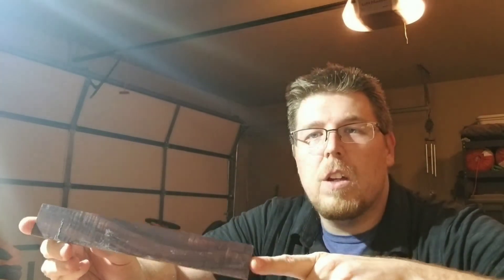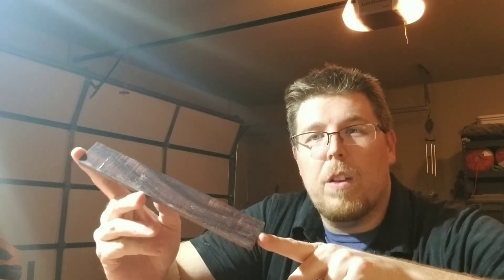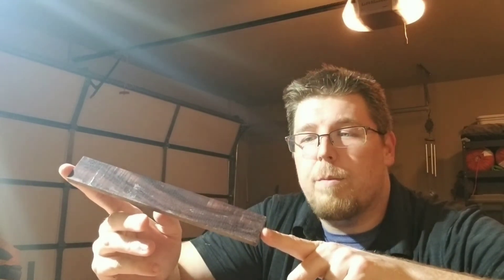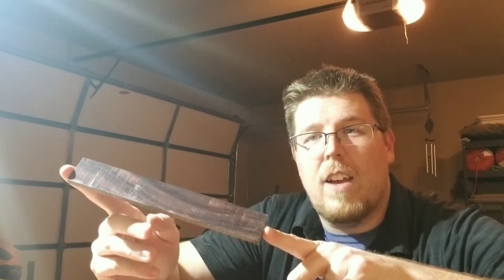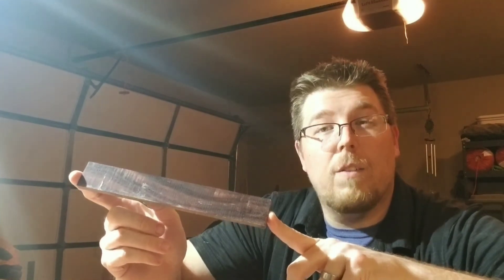Probably the most intriguing wood I have in the shop — and I don't have a lot of it because it tends to be expensive — is called katalox. Katalox is a very hard wood. Wood is rated on what's called a Janka hardness scale, and anything over 800 is considered hardwood. Katalox has a Janka hardness of around 3,800, so it's extremely hard and can be difficult to work with. But whenever you finish a project with it, it comes out gorgeous — it has natural ribs of deep black running through an amber-brown background, and when you polish it, those colors really emphasize and add a lot of depth to the wood.